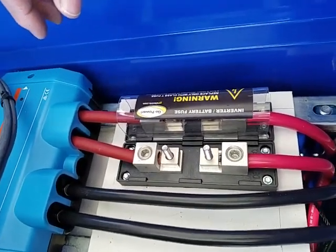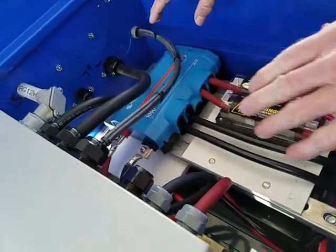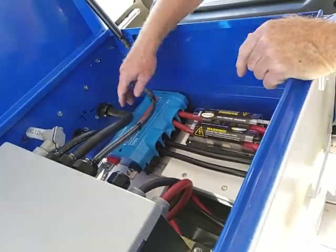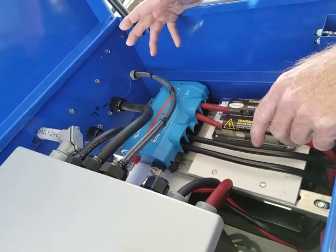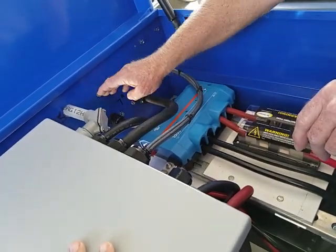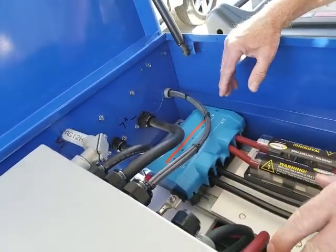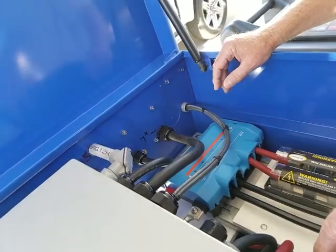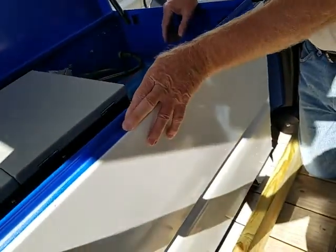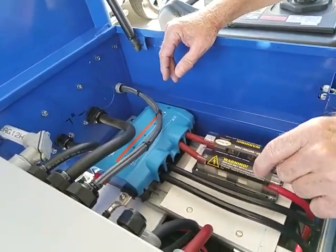Okay. So we're not going to have to take apart any of this, but we are going to have to remove all of the connection devices external to the box because we want to paint it, because when you drill these holes you remove the paint. And that could rust. What's going to happen over time, all of these penetrations are going to rust, and we're going to see rust stains run down. So once we've agreed that everything is the way we want it to be, I'm going to take off all the external connection boxes and we'll paint the outside again. There's a primer coat on it now. As you can see, it was blue originally. We won't have to take apart the entire system. We'll leave it blue internally. And then we're going to put our decals on here, which we'll see a little bit later on.